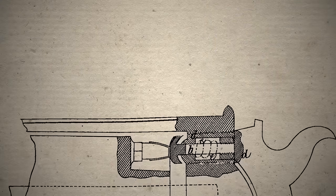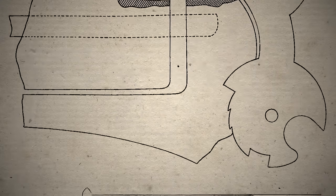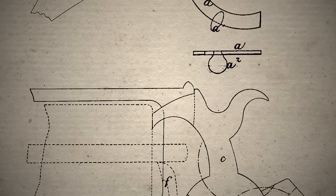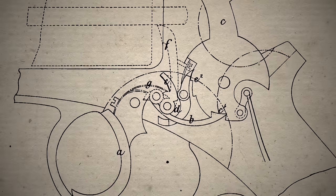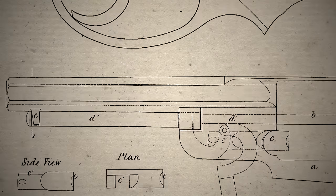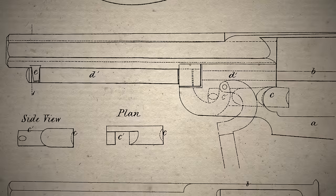Cousin John had apparently been employed by or contracted with the London Armory Company, during which time he developed several unique inventions pertaining to revolvers. His 1857 patent covers a wide array of features: a floating firing pin set in the frame, a round sliding safety which fit inside the recoil shield, a very uniquely arranged lockwork specifically designed to make use of circular cutting tools. A Kerr-style compound rammer was fitted under the barrel such that it could retain the central arbor.